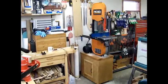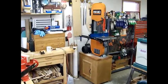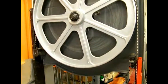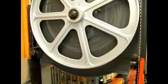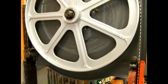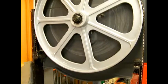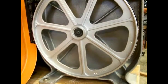I went through a tune-up on the bandsaw itself, balancing the upper and lower wheels and replacing the original rubber tires with urethane tires. The upper wheel required the most balancing — you can see the spots where I did a little spot drilling on the ribs to bring it back into balance. In my Facebook photo album you can see the number marks I made when checking the balance; it was pretty heavily biased between these three ribs right here.